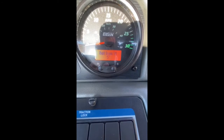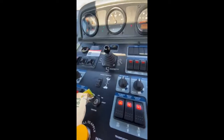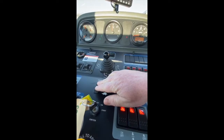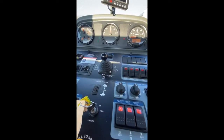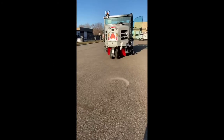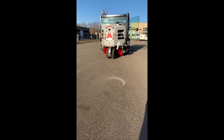I'm going to change my tilt to about five degrees. I'm going to run my RPMs up to about 1500 and just let the broom scuff the ground. Once you've run the machine in place for 10 to 15 seconds, pull the machine forward and look to see the pattern on the ground.